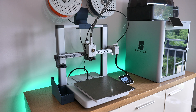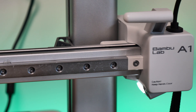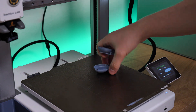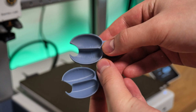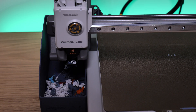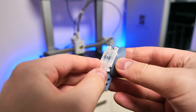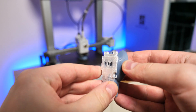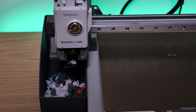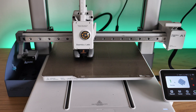To get this project started, I fired up my brand new BambuLab A1 and printed two buckets with two different printing directions for the Pelton turbine. I did this to figure out the best way to print the rest of them. It's pretty clear which one turned out better, so the printing direction is now confirmed — I'm going to print all 23 buckets upright. I also wanted to see how much better it would turn out if I use special BambuLab support material and keep them laying flat. Yes, it's better, but it uses more material and increases printing time massively because it would have to change filament every layer.